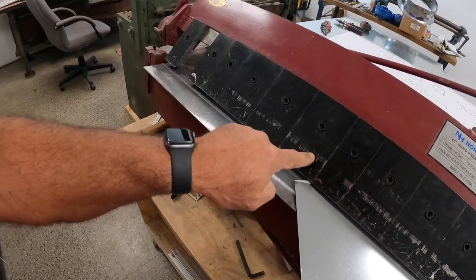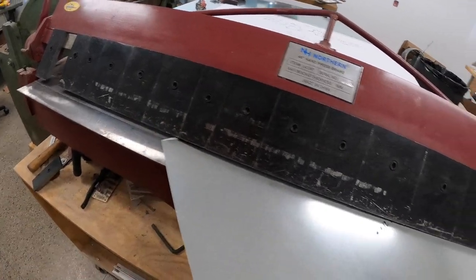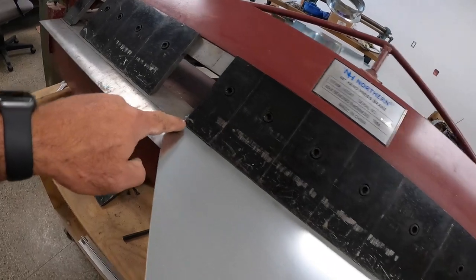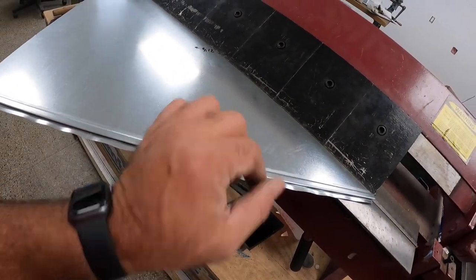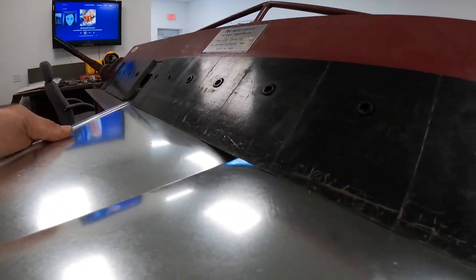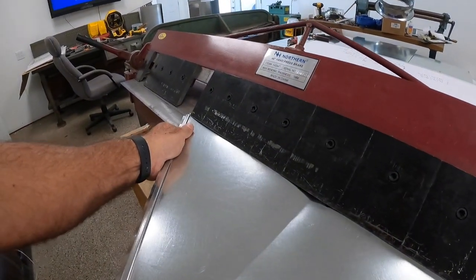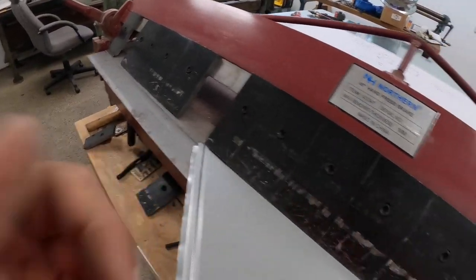We'll pull this one out right here, and then we can cross break it both directions without messing up the Pittsburgh too bad. So it'll be a diagonal cross through here. And we're on the inside. We can tell by this seam because this piece is the fold up on the outside. So give it a good proud break there. I think we can get something like that.